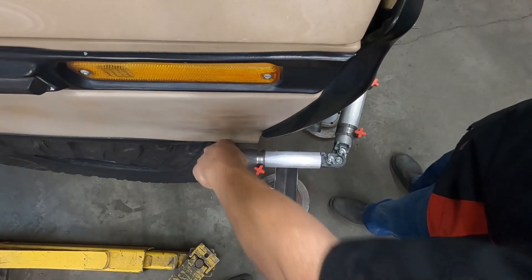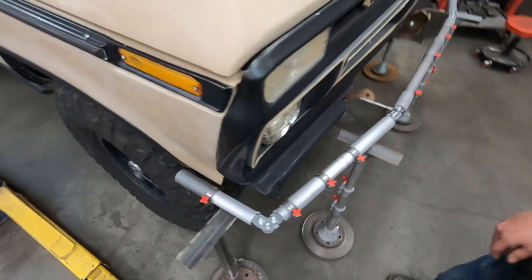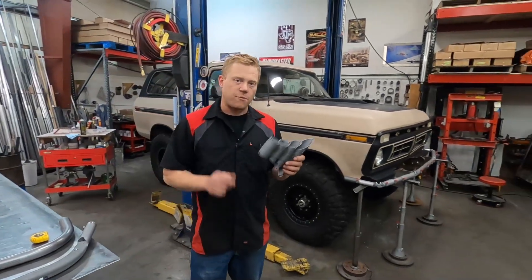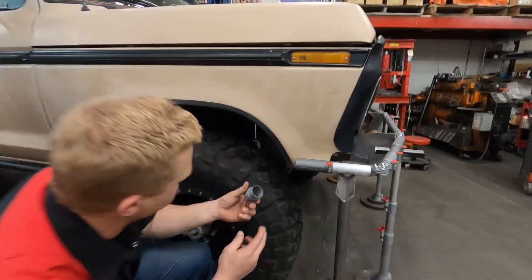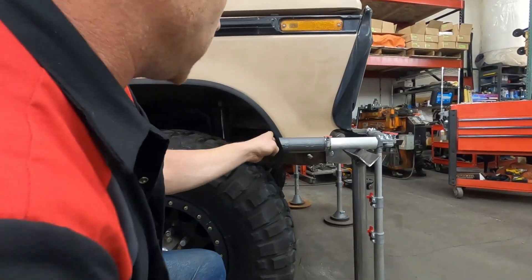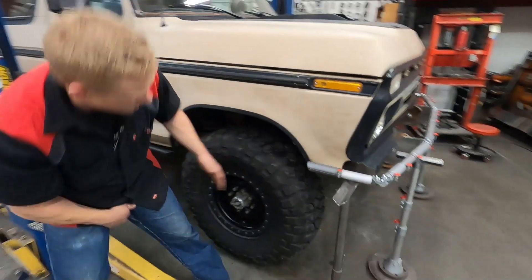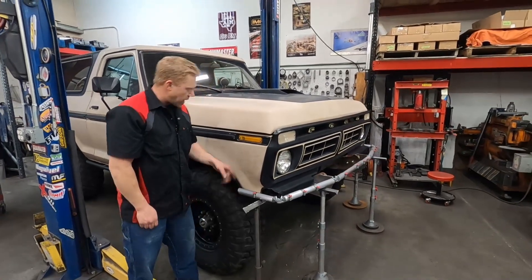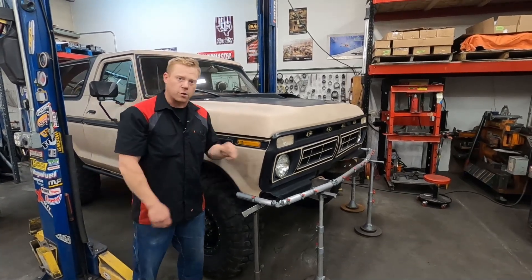You can see this is in line, and we've got our one finger gap here — that's the amount of room I'm looking for. Now to finish this off, we need one more thing, and that's going to be finding the miter for where this tube is going to end over here. This 20-degree miter is going to get me pretty close. I think I'm going to come shy a little bit — that rotation is kind of what I'm thinking is going to look good. So now all I need to do is measure this distance and match it on the other side, and then the jig is done and we're ready to pull it off and start making a tube.